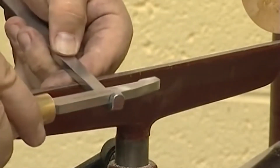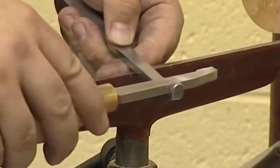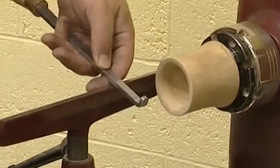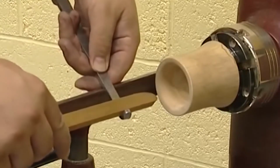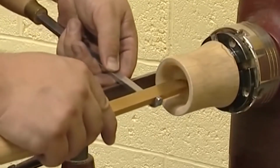This movement of both tool and support helps to give more control to the cutting tool than may be possible by just extending unsupported over the lathe tool rest. The tool support may be used with 3 different tools, all involved in the production of internal threads. Firstly, in conjunction with a curved scraper.